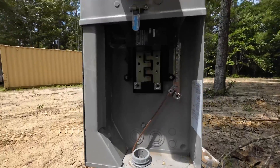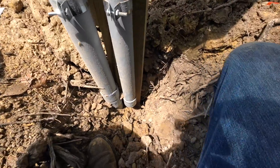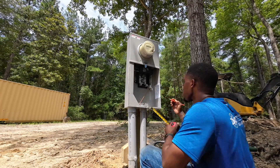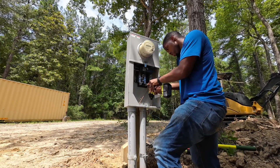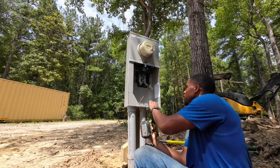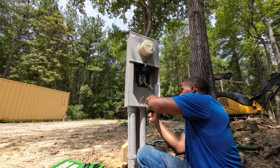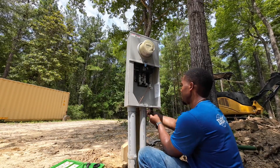Here's the pole that we're going to be working from. Basically my job is to make a two-inch hole on the right side so we can have our conduit coming down and have a 90 at the bottom. I'm just marking a line so that everything can be leveled and lined correctly with the other two that we already have there. I'm using my quarter-inch drill bit, then I'll follow that up with my three-eighths drill bit, then I'll get my knockout kit and knock that out at half-inch, then follow that up doing it in two-inch — and that's how we'll be able to put our fittings on there.